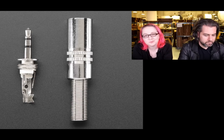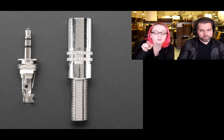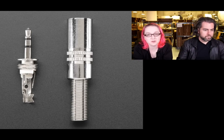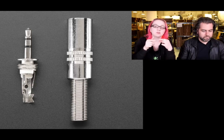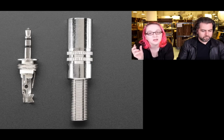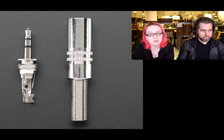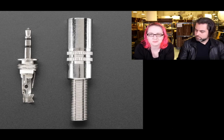You can use stranded core wire — 22 to 30 gauge is probably fine, you can go thicker if you want. You can crimp the wires on and then they slide into the middle part, which has a spring — and the metal base screws in for a solid metal connection. These are really durable. The spring provides very good strain relief, flexible enough for any kind of wire. This is the 2.5mm stereo audio for cellular and audio recorder applications.